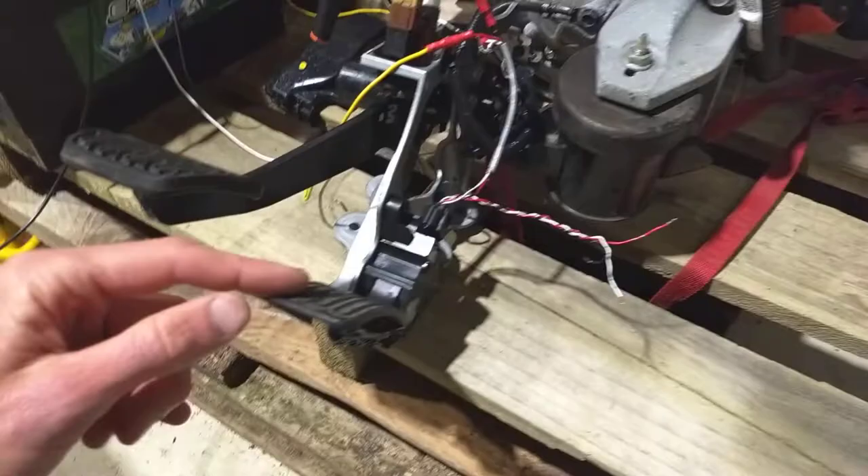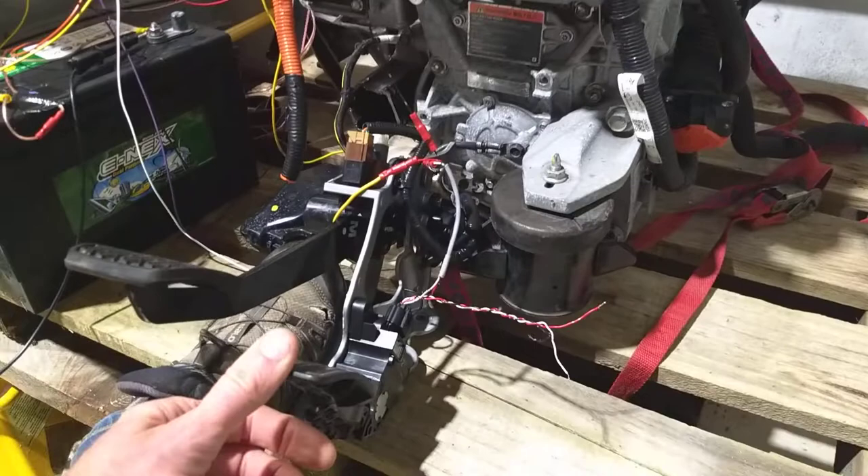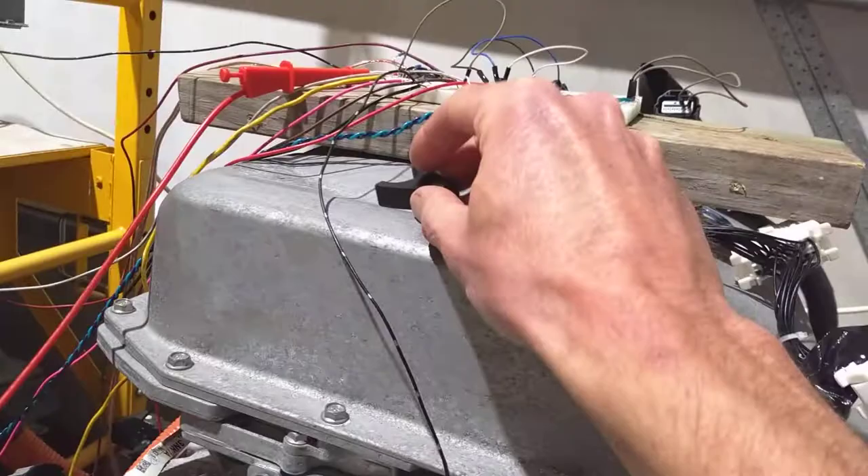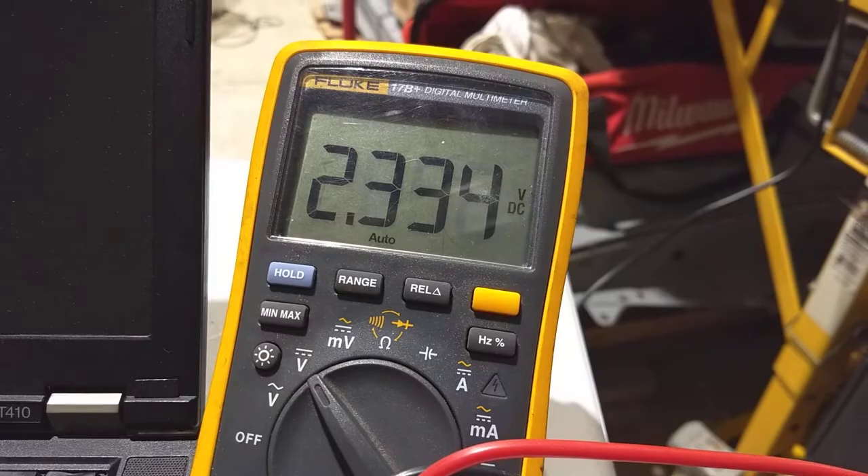Here's something to stop the throttle from pushing around. Now, this is showing a voltage out on one of the inputs — that means it's in reverse, and you can see it's winding down to nothing really slowly. If I fiddle with my little trim pot here from an electric bike, get that down to about the 2.5 volt region — now we should be going forwards, and it should regen, it should stop real quick with no inertia. There we go, forwards now.